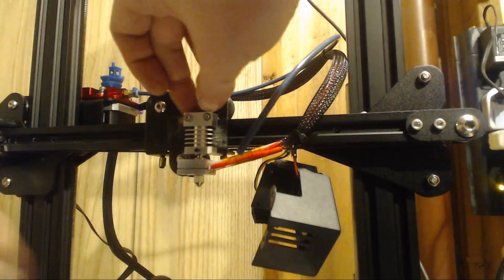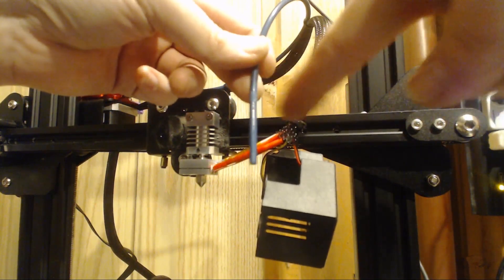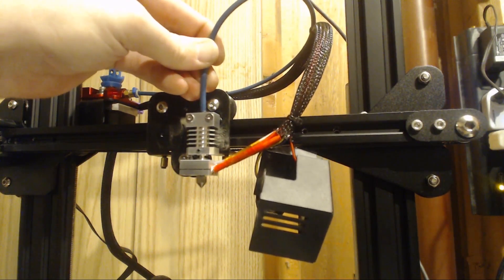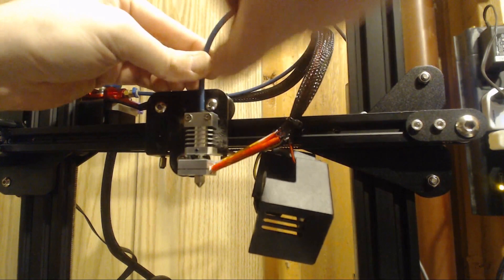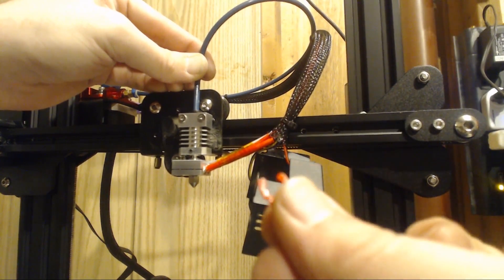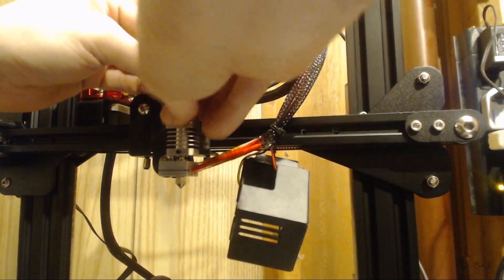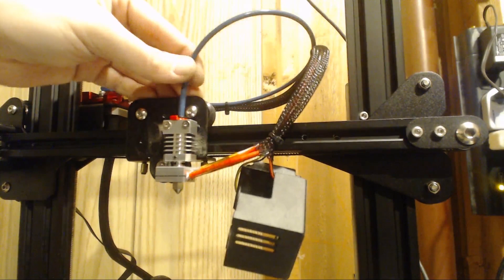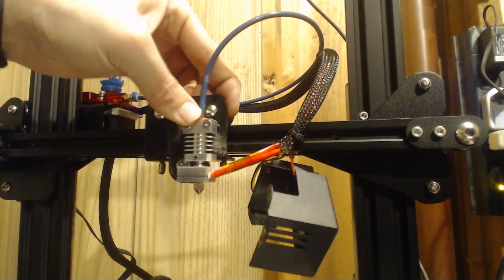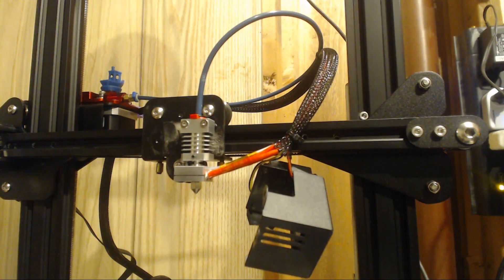This part is fairly easy. I've already cut my tube from the burnt part — there's about this much that burnt up in the filament. All you do is push until you can't push anymore. They send these awesome little retaining clips for that heat sink — you just grab it and push it on. That pushes the sock up and the connector above, holding everything nice and tight. I can't pull the PTFE tube out, so I think we're good.